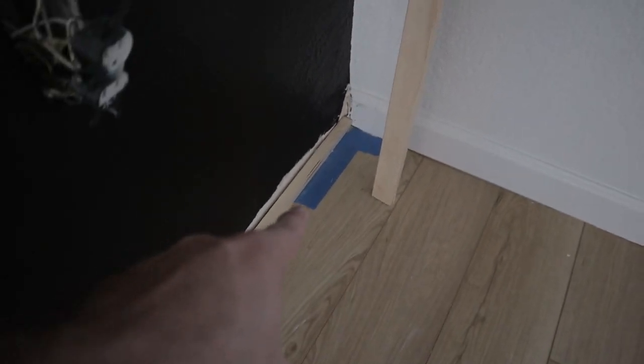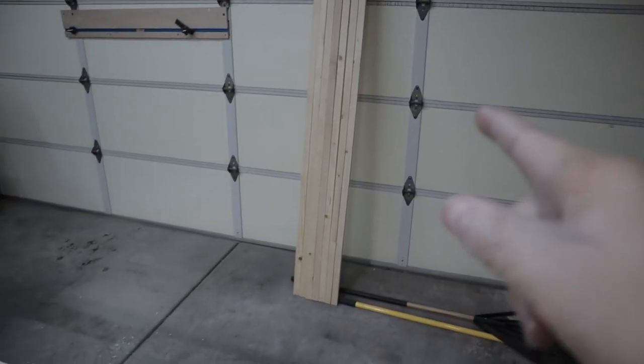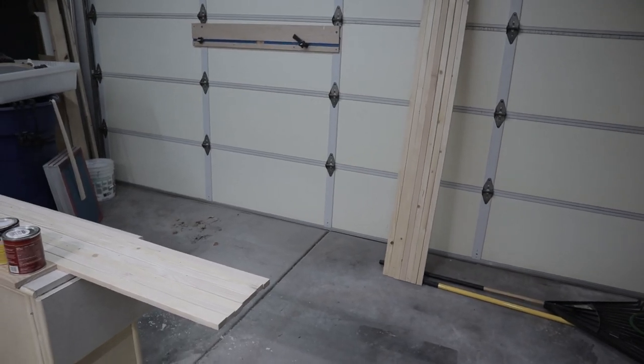With painting out of the way, it was time to rip a piece of one-by-two to the correct thickness. We got it over at Lowe's, took it to the table saw, and matched it to the thickness of an existing piece so the slats would flow seamlessly into the floor. This saved us a lot of money on trim. These have been stained with wood conditioner and these have not — as you can see, it also changes the color a little bit.